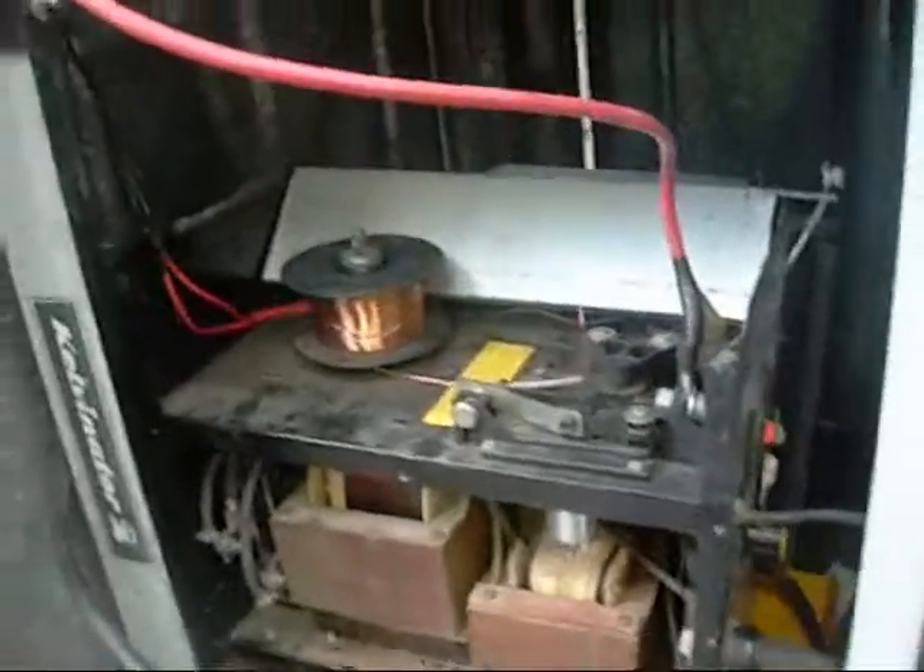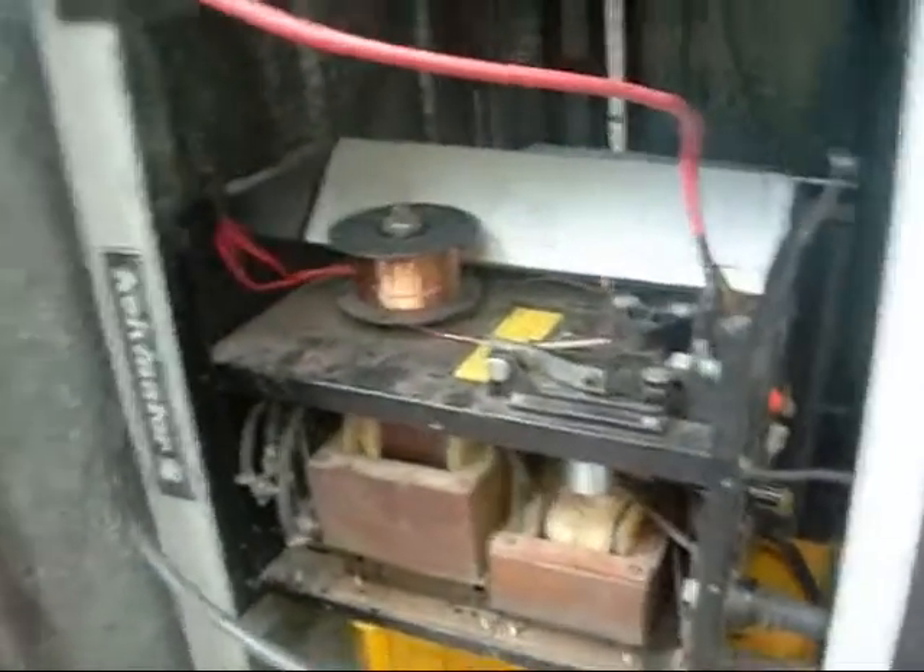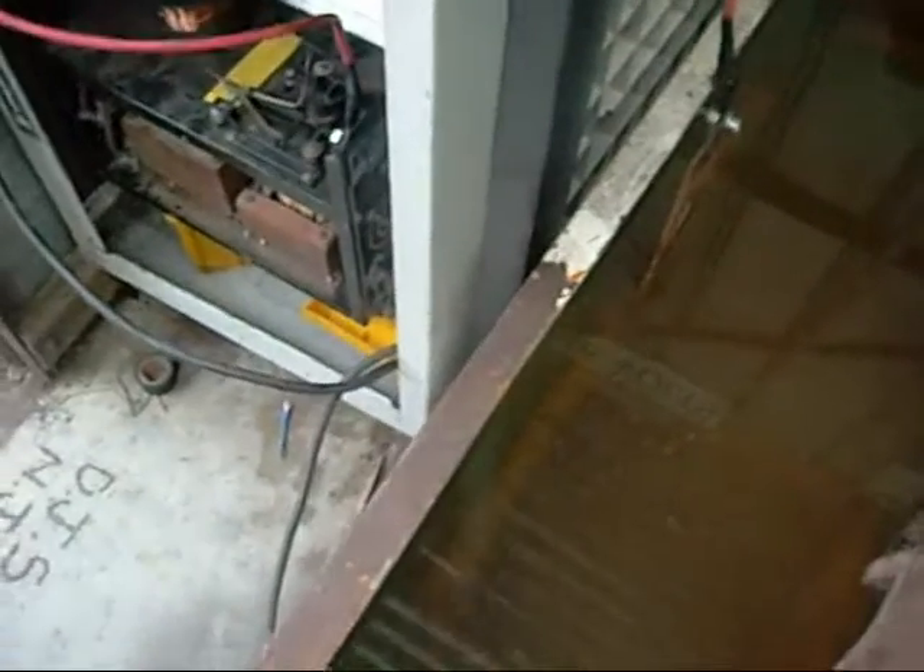I've decided that installing an amp meter on this is too destructive to the welder itself. I still want this to remain a MIG welder. If it unintentionally burns out because of using it as an electrolysis power supply, I won't be so pissed off. I don't want to go uncrimping aluminium wires because I can't solder or crimp them again. The whole lot is bundled together up in there — that's the one I've got to put the meter across before it goes into the DC choke coil.